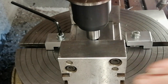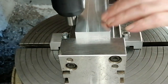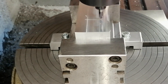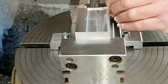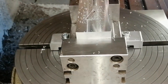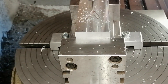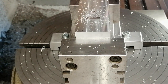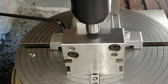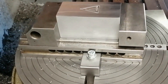There are plenty of ways to machine a triangle on a rotary table. These next two use the floating pin technique to locate the part or the vise. I start by engraving the triangle with CNC just as a visual reference. In the first method, the apex of the triangle sits over the centre of the rotary table. In the second, I move the centre of the triangle over the rotary table centre — that way the end of one cut becomes the start of the next, much faster once you get the hang of it. It's the preferred approach among machinists.